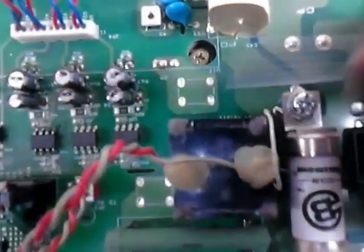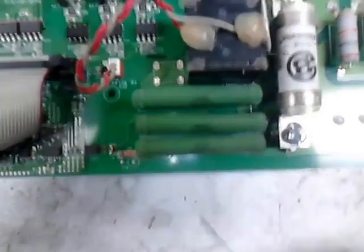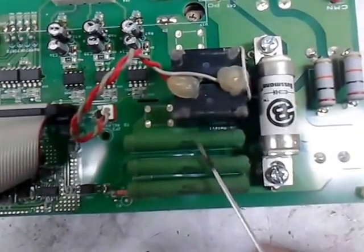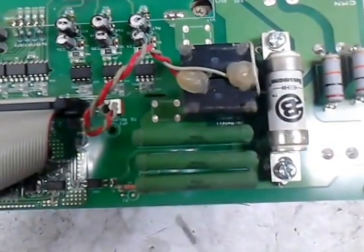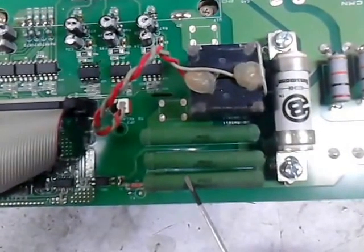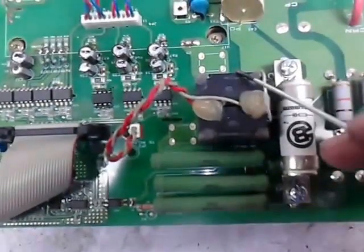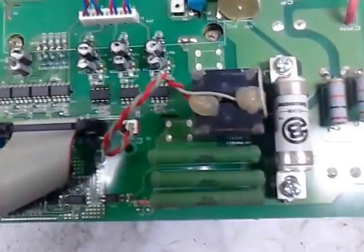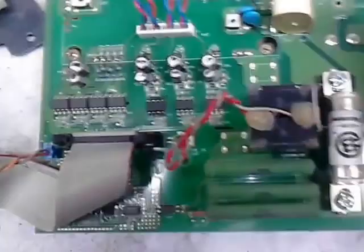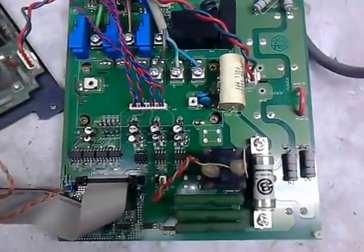Okay, these are the resistors for starting current. When we start the drive, there is a high current flow through the circuit, so this is for safety. Actually it is a charging capacitor current. So when it gets turned on, the relays shift these resistors and directly supply flows in the circuit. So this was a simple brief discussion about how it works.